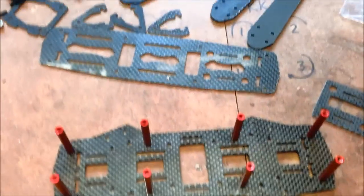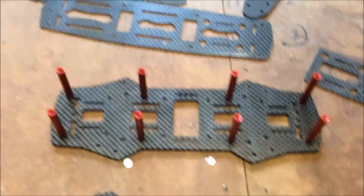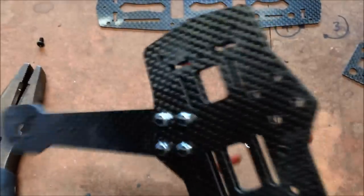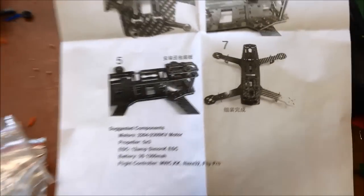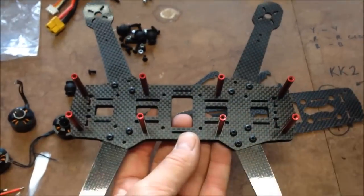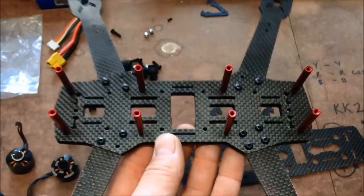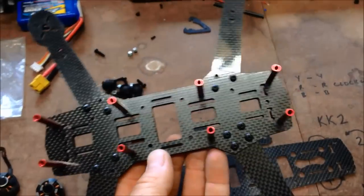Step 1: make sure you leave these four holes free for the arms. Step 2: motor arms on. It's actually a pretty straightforward build, and for the first time ever it comes with step-by-step instructions — something new. Just a bit of advice: don't tighten up any of the bolts until you've got them all in place and aligned, otherwise the frame won't be aligned properly.